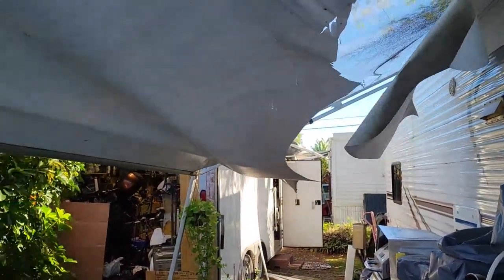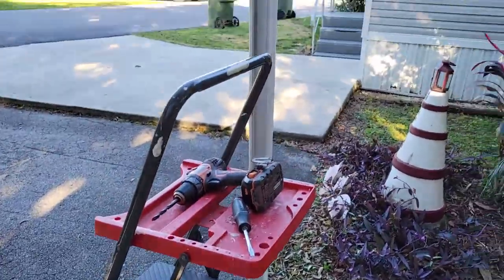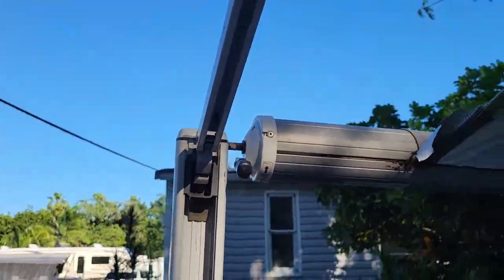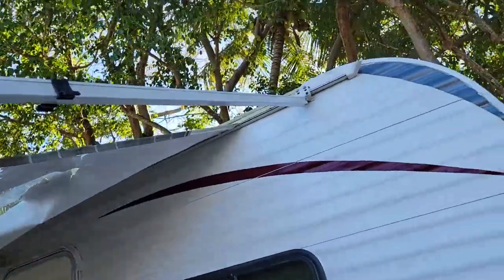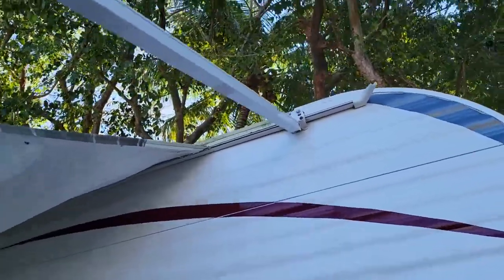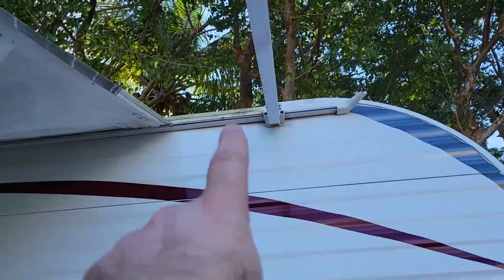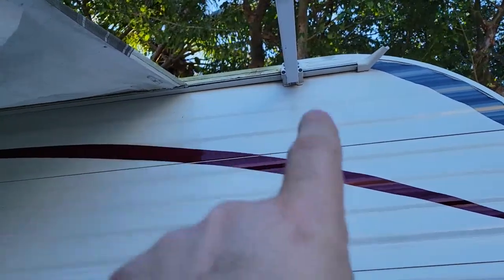You can do it one person or two persons. All you need is a little stepladder — not even a stepladder, I got one of these. Everybody always shows you how to take the whole thing apart, take the spring out, restring them, and remove this off the building. Do you really want to do that? What I'm going to do is cut a little slot right here in the bottom portion of that track. I'm going to bend down the back of it, bend up the front of it so that the awning can come this way underneath that.